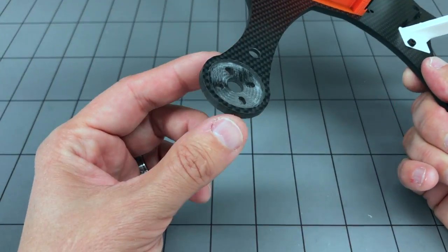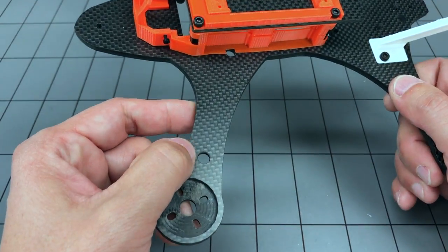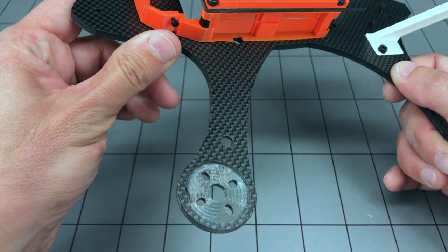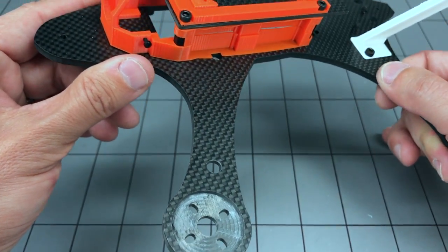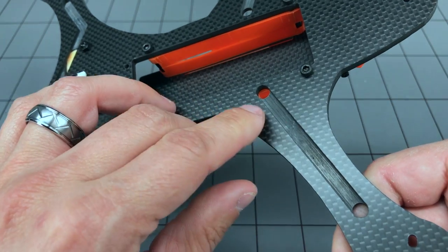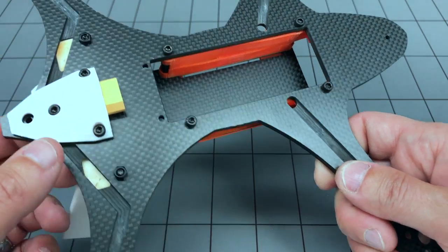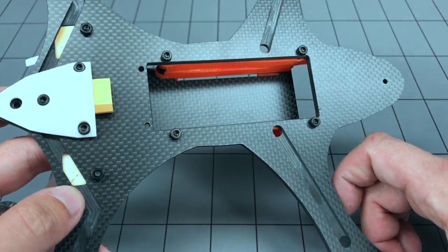The wiring for this will be a little different than on a standard mini quad. Some other interesting details: look at the little pockets for the motors — they provide a little bit of protection on the lower bell and windings. These holes that the wires go through will need to be chamfered, since wires passing through a carbon plate need protection. I've chamfered this one slightly but I'll take a file and smooth it out more on both sides so the wires have a nice smooth bend. They've done a lot of thinking about the wiring layout to keep it smooth against the bottom, and they recommend a small spot of glue to keep the wires in place.